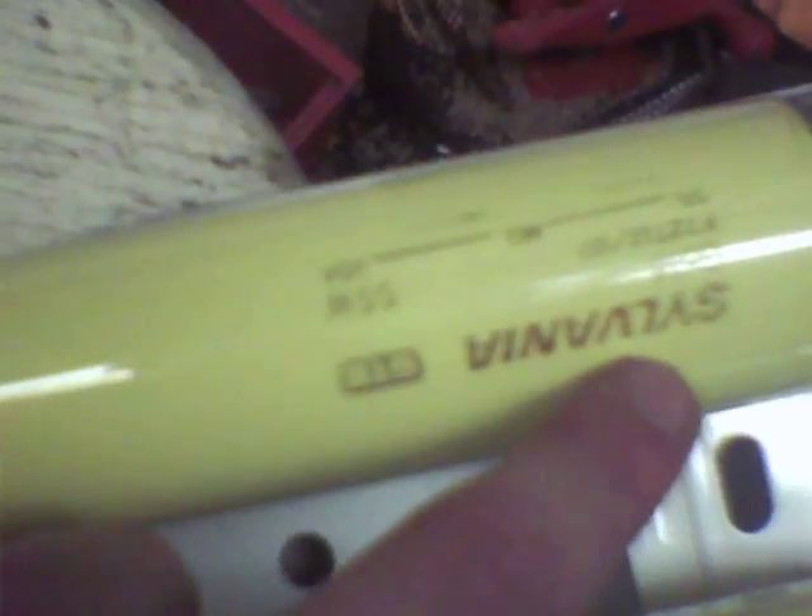I screwed in the lamp holder retention plate and put in the slimline lamp holders, because this takes F72T12 slimline lamps now. These are F72T12 GE Sylvania GTE gold lamps that I got a full case of some years back with the intention of building a fixture like this — for less than a buck each, which is normally 25 times that, so not bad at all.